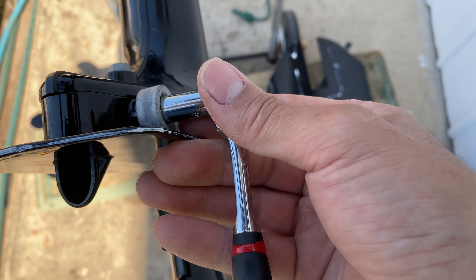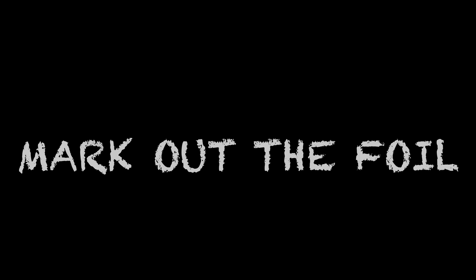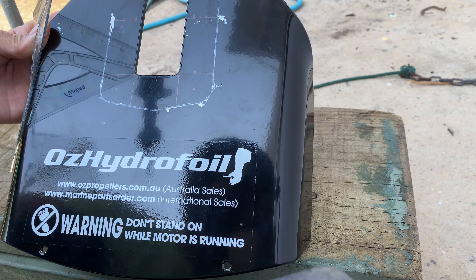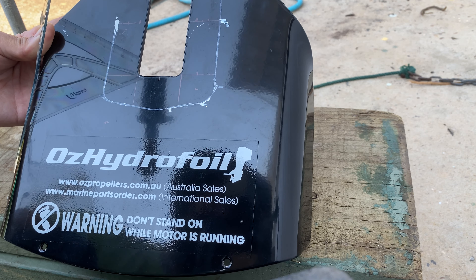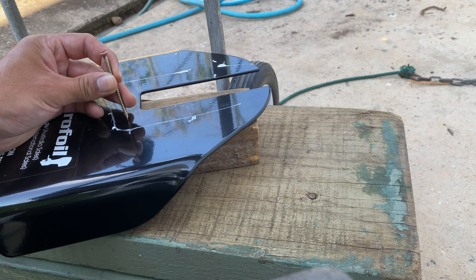I'll find some rags and clean that off — just a quick little clean. We're just going to remove this little anode here using a lefty-loosey method. Kerblam! Clear run to drill the cavitation plate with the power drill. I've got it marked out. I won't tell you where the markings are because it might not be great and I don't want some angry hate mail. I'm just putting in four bolts — there's not enough room on the actual plate for more than four bolts. Making sure there's enough meat on the cavitation plate and it's not going to hit the sacrificial anode. Couldn't find a center punch so we're just going to use this screw — hopefully it works out.